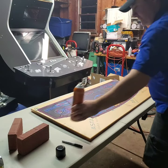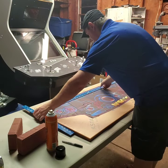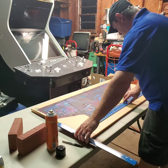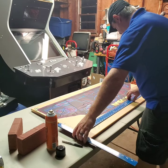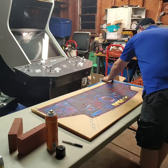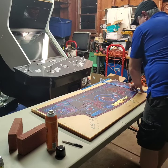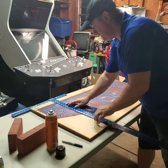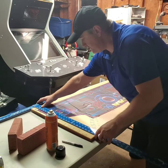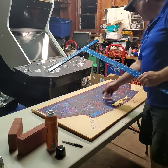After you get this laid out, you're going to want to do all your measurements. Make sure your center point is where it should be all the way to the end — 24, 24, yep. Make sure all your lines are straight. This drywall square is a great tool — you can check all your lines and make sure everything is straight all the way to the end. All the way to the end, that should be dead center right here.